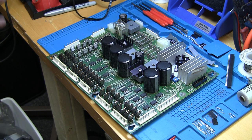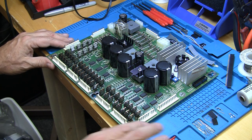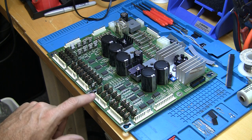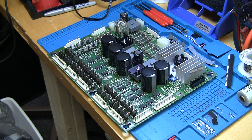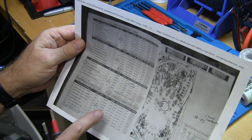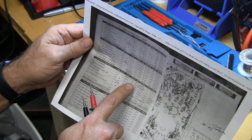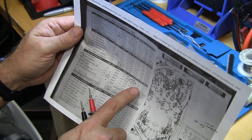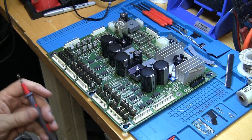So now I'm back to square one. There's a very good possibility that the line from the transistor to the coil is broken somewhere. If I was smart I would have checked that before pulling the board. Usually when a coil is blown you expect the driver transistor to be blown too. Looking at the coil list sheet, for the right slingshot the power feed is J7P1 and the transistor switches to ground on J7P3.